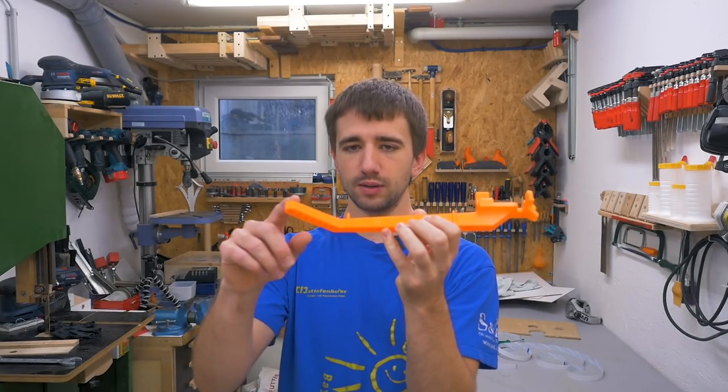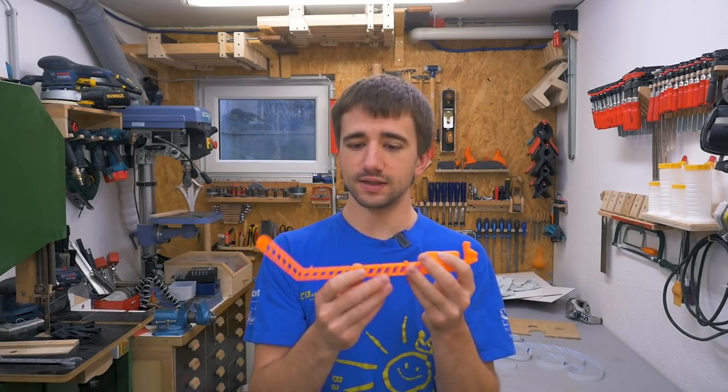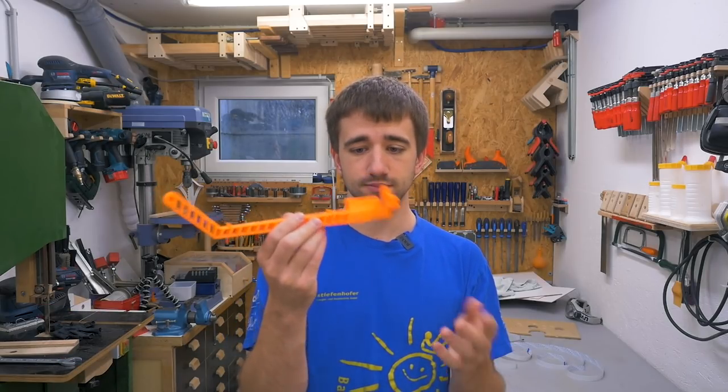This first version of my camera arm extension was a good example — not an easy part to print with lots of overhangs, but I put in the standard settings, hit start, walked away, and got a perfect result. I also recently changed out the bearings that came with the printer for Igus drylin bushings, because the original bearings started creating deep grooves in the shafts and were more grinding than rolling. Maybe I didn't lubricate them enough. But now I have drylin bushings that don't require any lubrication because they self-lubricate. Print results are the same as before and the printer is noticeably quieter.